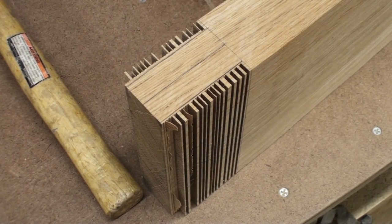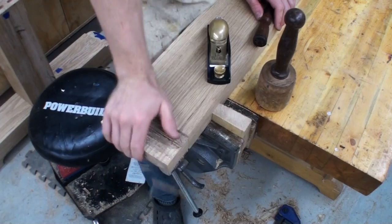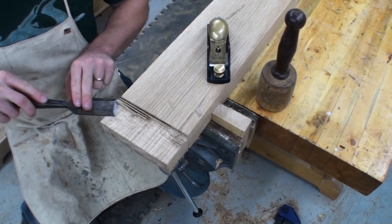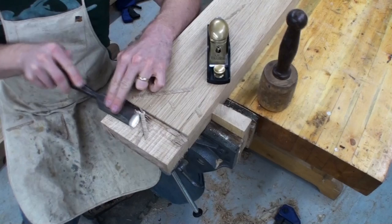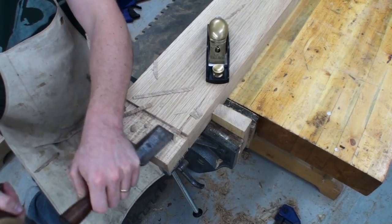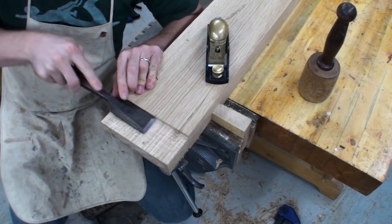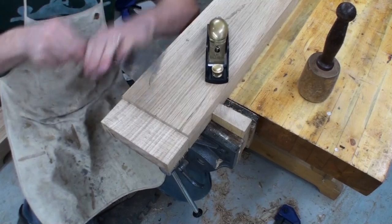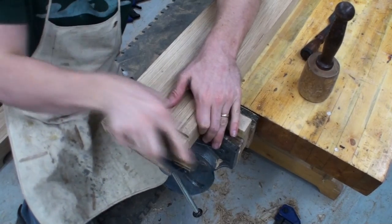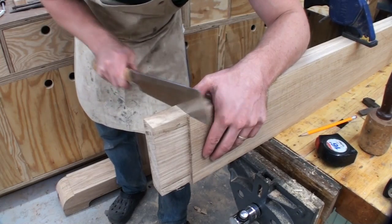Here's the result of all the cuts made on the radial arm saw, just to get the bulk of material out of the way. I could have used a dado stack but I just used a single blade, bumping it over a little each time — it's pretty quick. The little excess can just be knocked off with your hand, a chisel, or a mallet. To get things cleaned up, I rough it down with a chisel and then come in and refine it with the hand plane, bringing it down to its final thickness and checking its fit back and forth with the actual mortise.